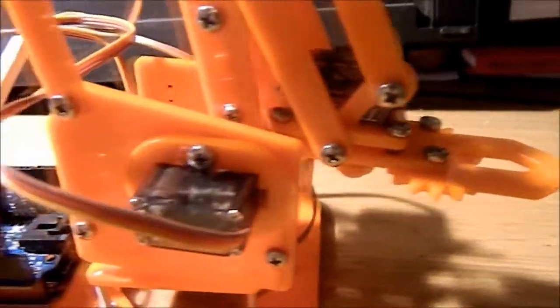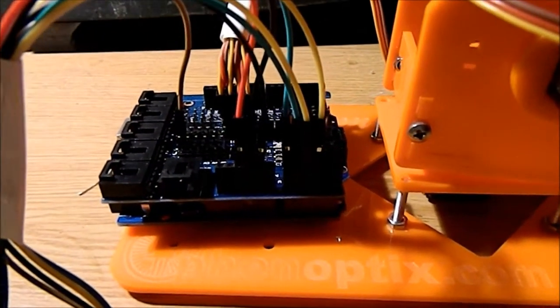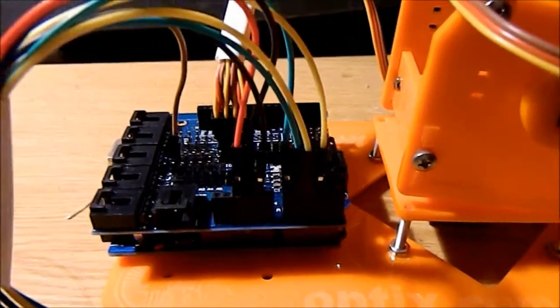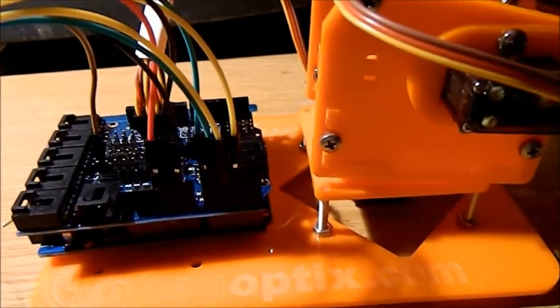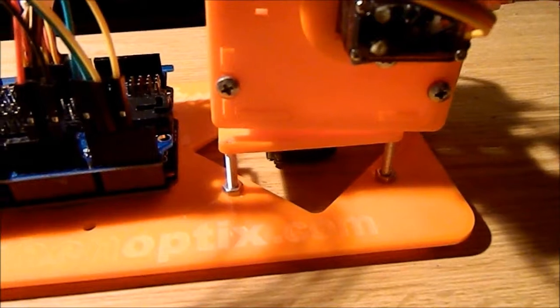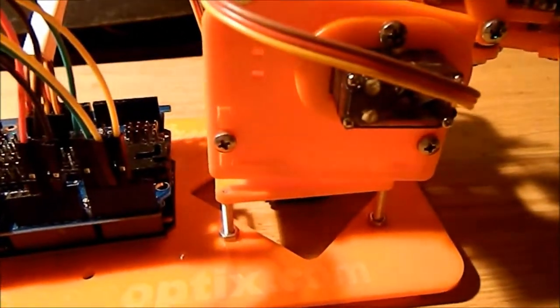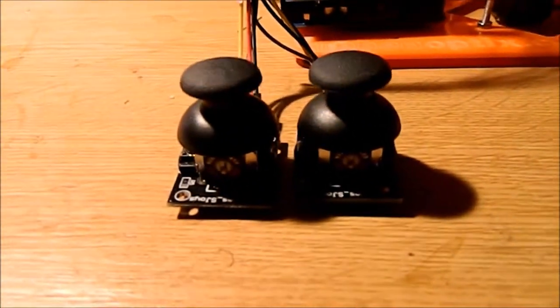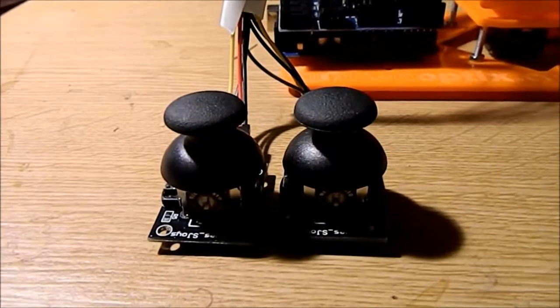So if you find that your joysticks aren't running the right bit, because you probably want the jaw to be an up-down movement so you can open up the jaw easily, and the main spindle servo that turns the whole mechanism left or right on the same one, as I've done, you can swap those around. It also means if you add anything else connected with the servo, you can just keep adding pins and stuff.